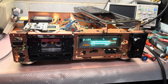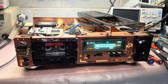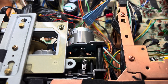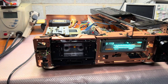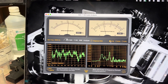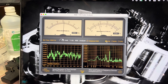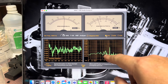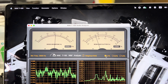I also tried the original Pioneer motor, but it was extremely bad — it shows 0.1%. Finally I installed the Mitsubishi motor, which I showed in my previous video. Here you may see results: it's even better than the BSL motor — it's 0.031% weighted RMS. The biggest contribution comes from the capstan but it's not big and it's manageable. I see 0.029%.